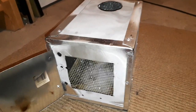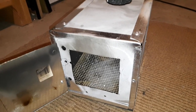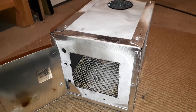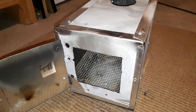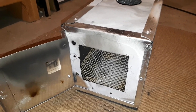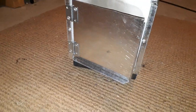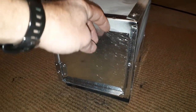This stove I made from four pieces — they're all eight inches high by different lengths. These are 14 inches long, so the four sides are all 14 inches long. Then I bought two other caps which I did cut down just using a pair of tin snips for the ends and another one for the door. That one I just left a couple of the edges on it so they would be a little sturdier.